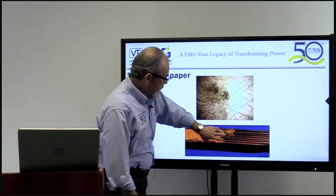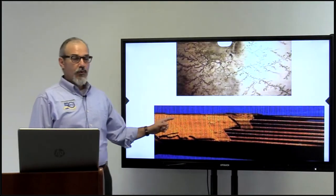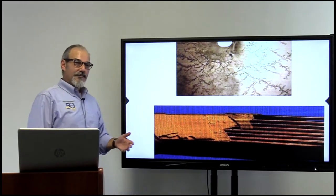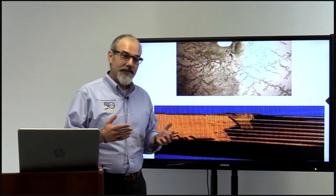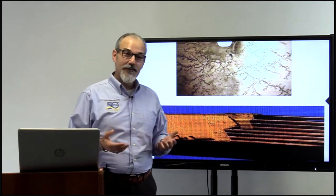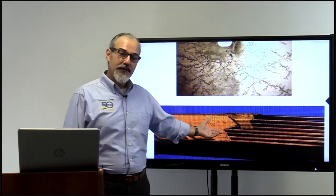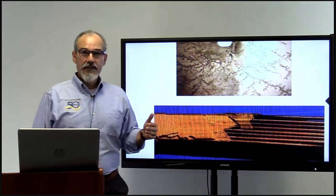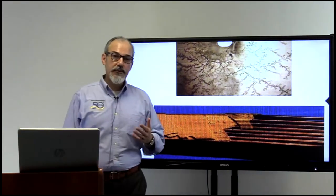This here is where insulation has pretty much overcooked over time — just like overcooking a turkey. The insulation around the conductor works the same way. If you run your transformers hot, the insulation will age very quickly, because the water will dissipate.